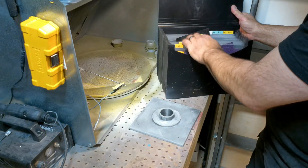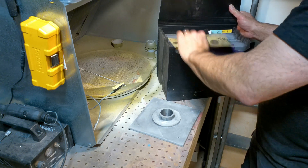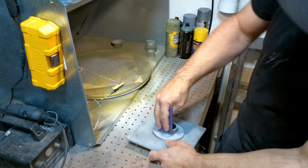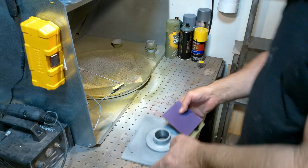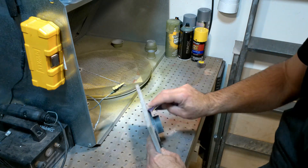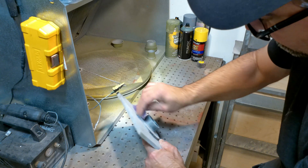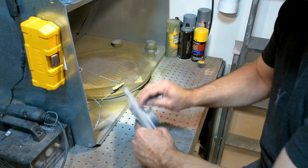This particular piece is made of ABS. I basically do this process with all my 3D printed parts. I start off with about 120 or 150 grit sandpaper on the rotary sander, get it sanded down as much as possible, then come back with 220 grit and do all of that prior to adding primer. That's what you're seeing here.